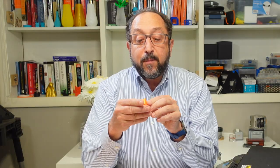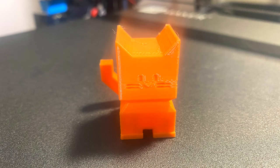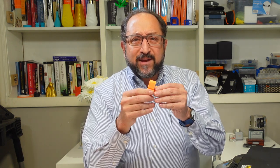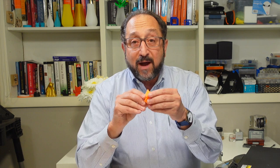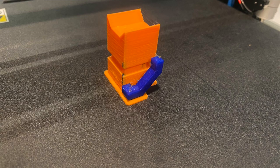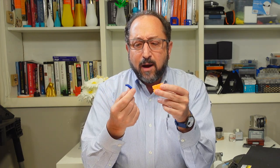The first model I printed was a calibration cap. It printed well except the profile was set to 210°C, so it came out a little sloppy with one extrusion issue — I assumed that was a catch in my filament reel. Then I went into Tinkercad, loaded a model, and split it into a tail and a body. It printed properly but was very fragile — when I dropped it on a ceramic tile floor the tail snapped right off. It also looked a little messy, and I thought the temperature still wasn't optimal.